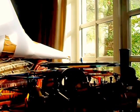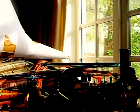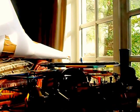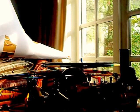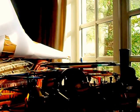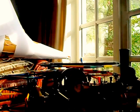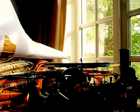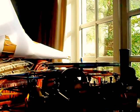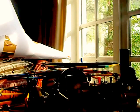Now before I had a different gear ratio on the engine, so the engine was having to spin really, really fast. Now that caused a certain amount of natural regulation, and rather the same way it's easy to keep a constant speed in your car when you hold a lower gear like second instead of fourth. Problem is it was using a lot of fuel and it was really hammering the engine and everything was shaking and vibrating. The engine going slower, there isn't all the vibration.